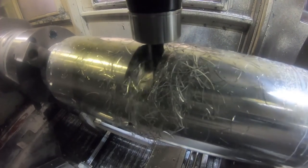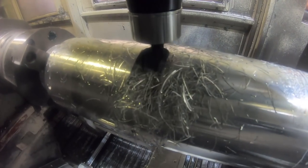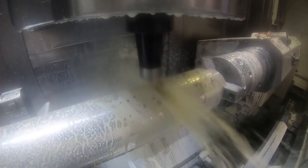The first notch it was doing, I think, is just a flat for, I don't know what it does. It's just a flat, maybe to hold some kind of a wrench on the part, possibly. This flat here is a flat in the area of a cavity that goes down into the big hole that goes down the part. And this just shows the half inch end mill roughing it off. And then I come back with another half inch end mill to finish it with.